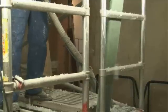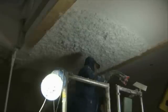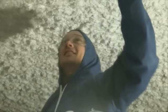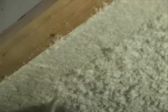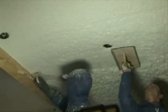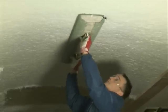Up to 100 millimetres of wool is applied onto the surface in a single round. More wool can be fed into the system while spraying continues. To adjust the hardiness, we use a padding board. It also ensures fine edges and corners. For the final touch, we use an aluminium roller to ensure a smooth, medium, hard surface.